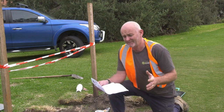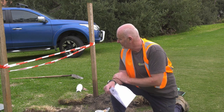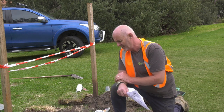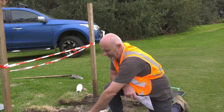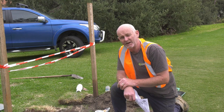So that's about it. I mean, not all these tests look like this. It's just I couldn't get into that reduced pressure zone. I could not get those ferrules off, so I had to sort of jerry-rig this up. But our normal test kit looks something like this: water meter, pressure gauge, and then a gate valve to adjust our flow. That's it. So we'll see you next time.